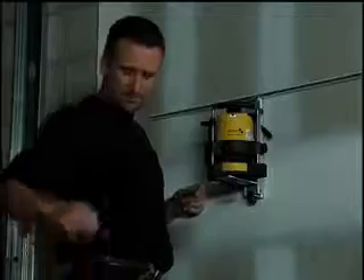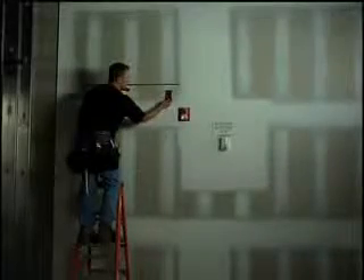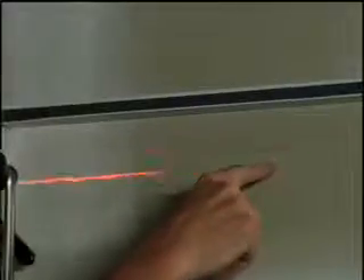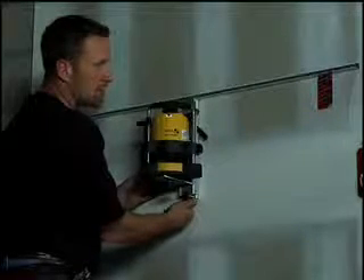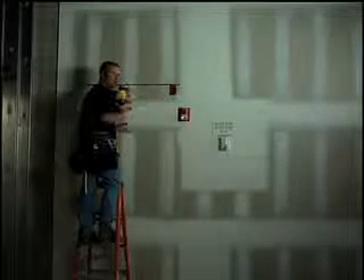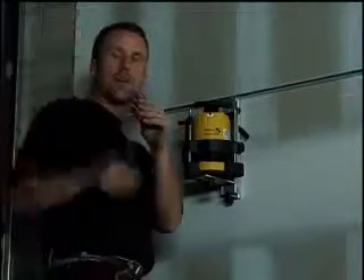I turn it on and the laser is going to self-level on its own. In the kit there's also a magnetic ceiling card designed to do grid ceilings with. We take our magnetic ceiling card and put it on the wall angle next to the laser. We're going to line up the laser two inches below the grid — the line on the card is at two inches. I take the adjustment on the bottom of the wall mount and raise the laser until that laser line is even with the white line, so I know I'm two inches below. Then I grab another piece of wall angle, move on down the wall, stick the card to the wall angle, and raise or lower the wall angle until the red line hits the white line and it's level with the laser. Continue that process all the way around the room. We follow the same process with our grid — connect the magnetic card to our mains, raise and lower it until the white line and red line meet up, twist our wire, and finish the ceiling.